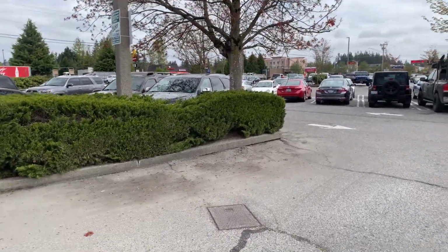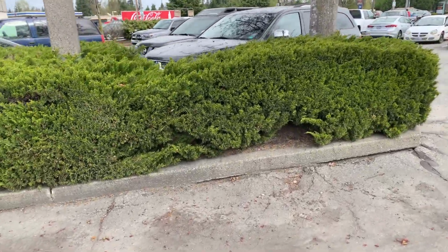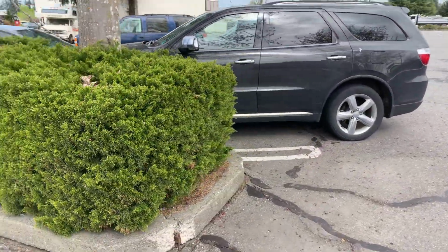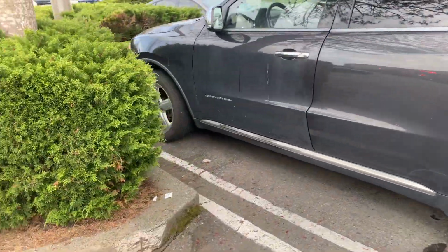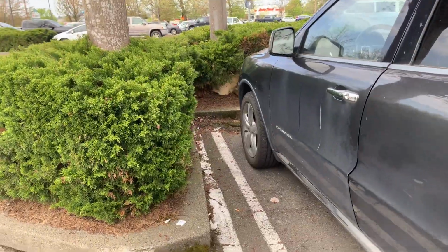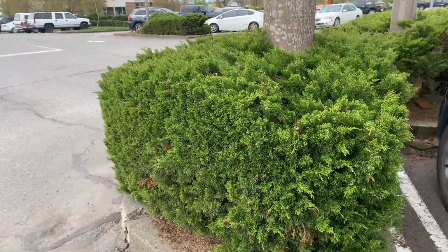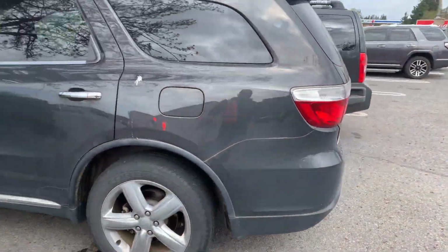Got iron, so this would have to be removed and replaced. And then we've got this curbing that'll have to get knocked out, which has rebar in it. We'd have to remove and replace this as well after we put the asphalt in. So we'd probably go right to this joint here, take all this out. This is 25 feet. In this area right here, you got tree root damage.